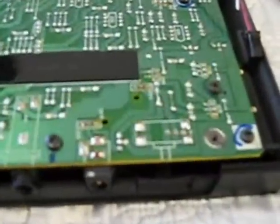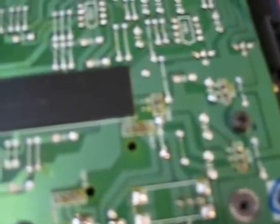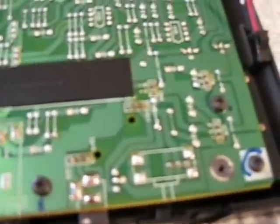The next step when removing the circuit board to get to the battery is you're going to have 12 screws to take off — all these right in the back. Make sure when you're taking them out, you put them in a position where you'll remember exactly where they go, because some screws might be longer. If you put a longer screw where a short screw should have been, you're going to have a problem. Just set the screws in the exact position that you had them, so when you put the board back in, you can put them back in the same positions.